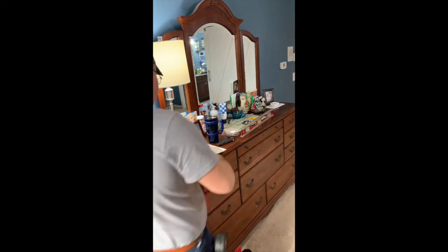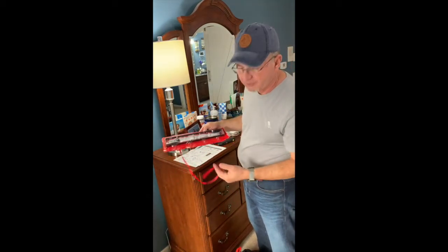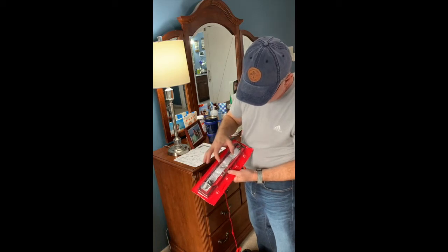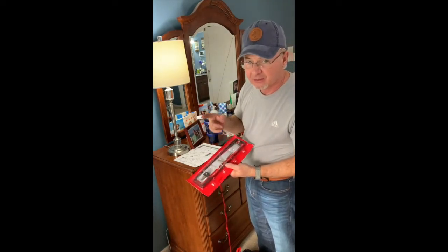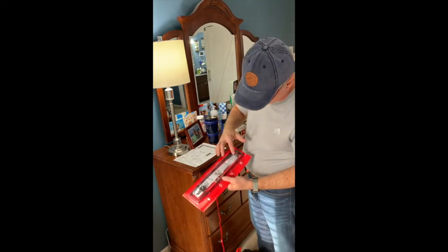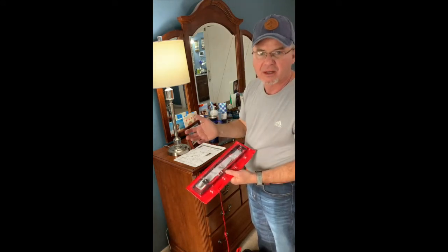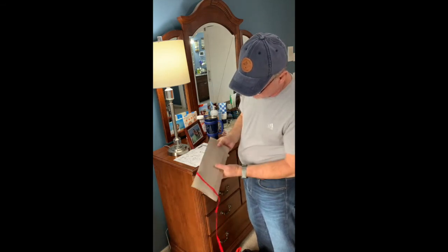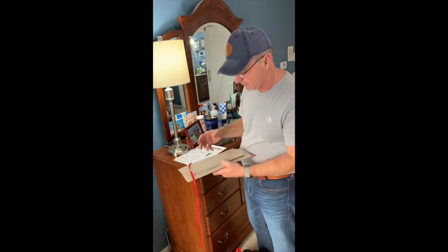This is the parts box. It has a nice little ribbon threaded through the side of the door so you can retrieve items inside. You have keys for the lock, door hanger hardware, screws, and wall anchors. The screws are longer than the wall anchors so the anchor can spread and gain purchase against the sides of the drywall. There's also double-stick tape for the door hangers so the cabinet doesn't swing when you open and shut the door. The small bungees are double-stick bumpers, probably for the inside of the door.